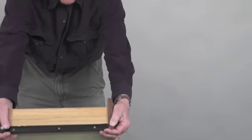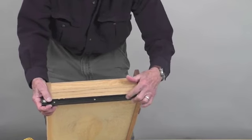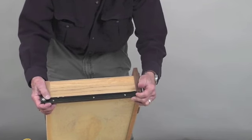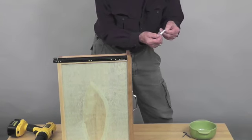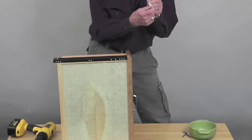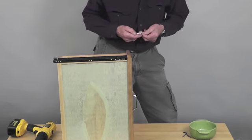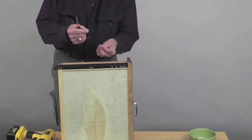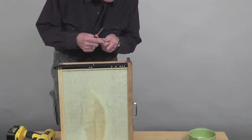I don't know whether you can zoom in to see those pilot holes, but the important thing is that this glide is flush against the top. We have a little package that says, use on the drawer side glide. We'll open those up. They're like 5/8 number 5 screws. Okay, then I take two of the little screws. I just finger start them.